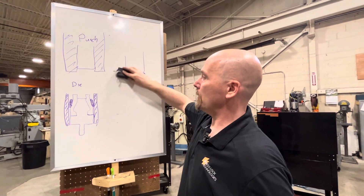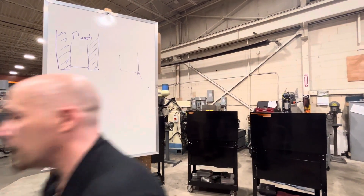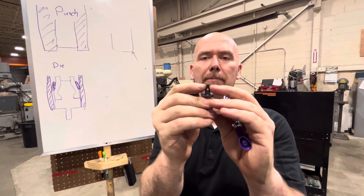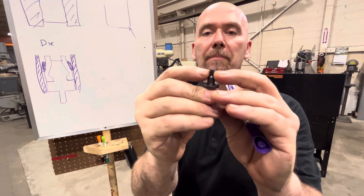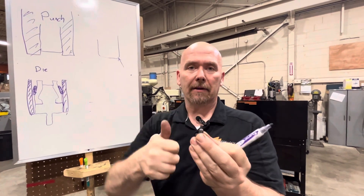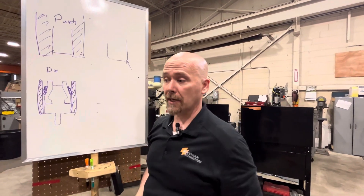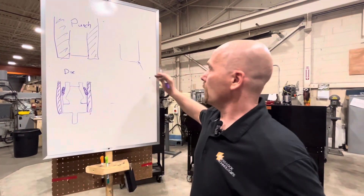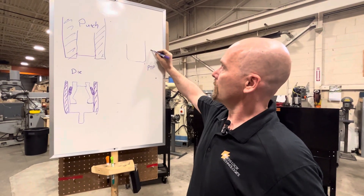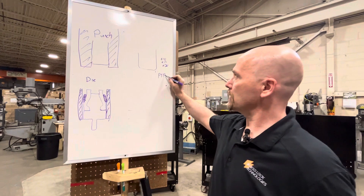So the punch is a critical part. This is roughly what a punch would look like — it has some geometry, but the real business end is right at that tip. The other thing that's quite important is the diameter. As it gets bigger, the tonnage goes up; as it gets smaller, the tonnage goes down, and the strength of the connection also changes with that. To summarize: we've got a punch tip radius — often called the PTR — in a number 10, a number 15, and a number 20.